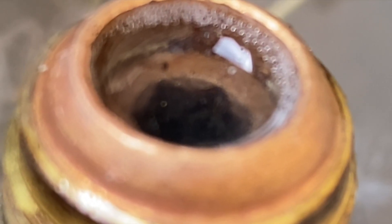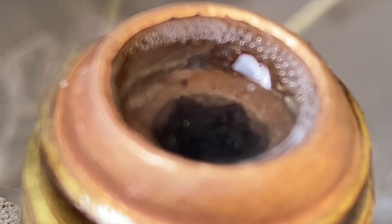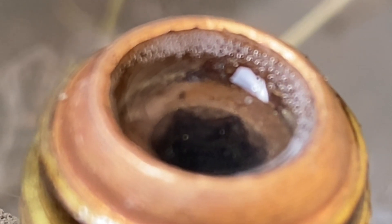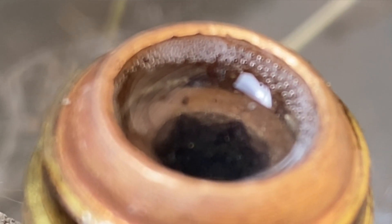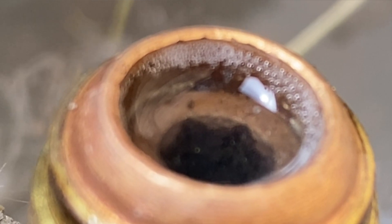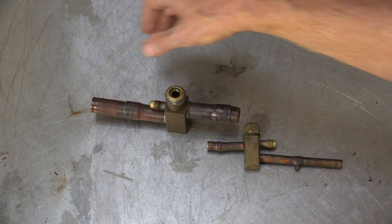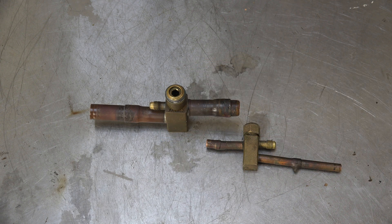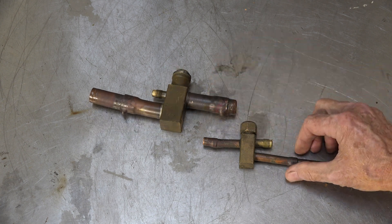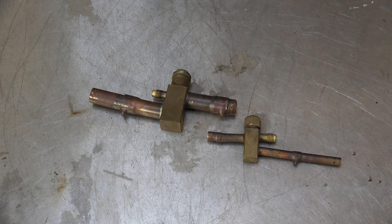Eventually it's going to leak, that's all there is to it. This is just a plunger in here. I have some old videos that I did about these things - taking apart and putting new seals in them. You can look at what they look like inside. That's all it seals here. Two things happen to these: number one, people overheat these fittings - not so much on this one, but on this one - and it warps the body and the O-ring leaks right away. The other thing that happens is after a few years of service, they leak.